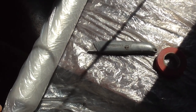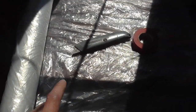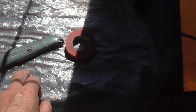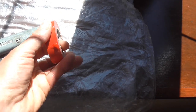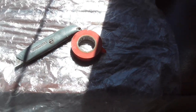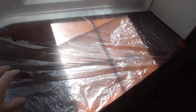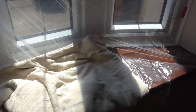That's the wiping down done. Now about to put some plastic over the window. I use this plastic on a roll — really good. Measure your window, measure what you need, cut it off, then I use some insulation tape to stick around it. I do find this is the best stuff to use to stay on the plastic. I've draped it over the varnished sill to make life a bit easier, and I'll put a dust sheet on top to protect the sill from anything dropping on it.